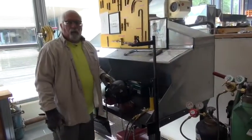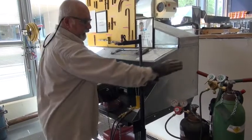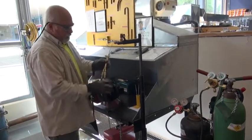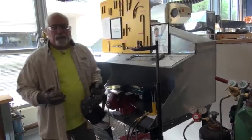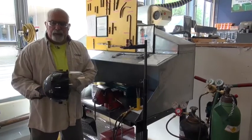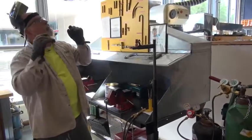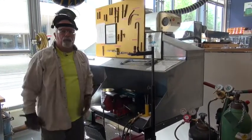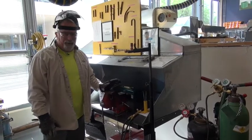We're over at the workstation. Safety is of utmost importance — all our gauges have been checked out. We have our tip and our tool, everything's been verified safe. For PPE, you should have your shirts, hoods, safety glasses, and the shield. When brazing, the dark shield is a number three darkness. We have our water, and we know all our instruments here.